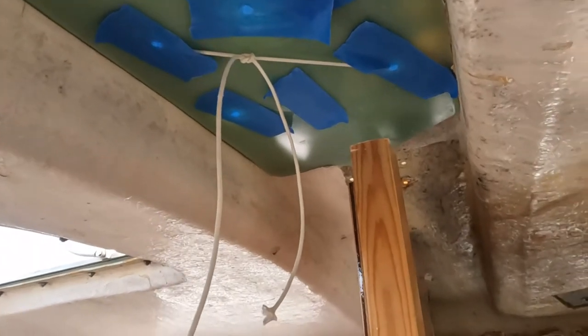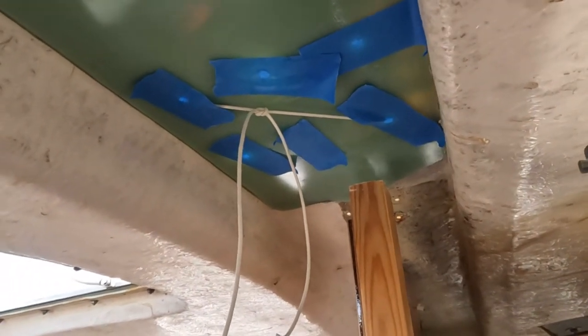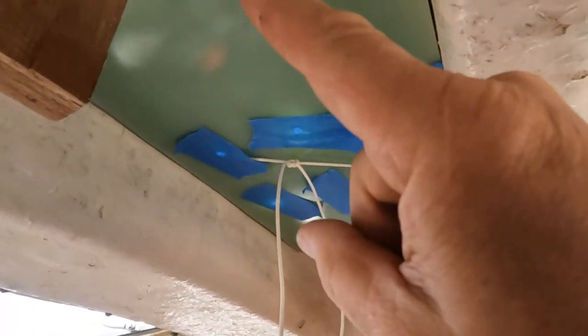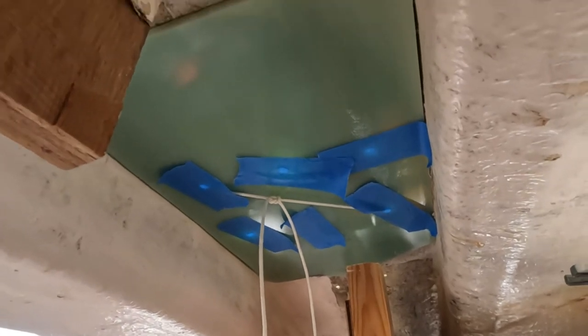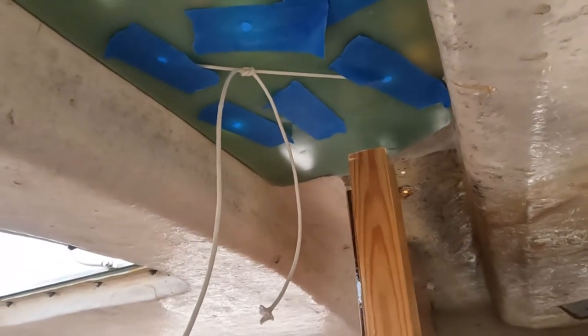Well, that wasn't as bad as I thought, so I'll probably be able to put the time lapse up — I'll just have to cut the bits where I was rushing on deck to tighten the string. It's up. I've learned my lesson — I'm going to let it go till it's a bit green and then take that tape off rather than letting the tape get fully glued on with the epoxy. It's got some gaps and I'm not entirely happy with that, so I will drill some holes from the top and pour in some slightly thinner epoxy that will run into those gaps. I'll put some tape up first so it doesn't come out, and I'll do that before this epoxy has completely hardened so I get a chemical bond.